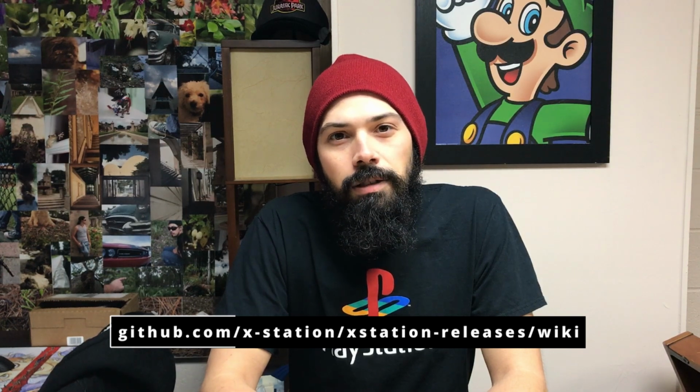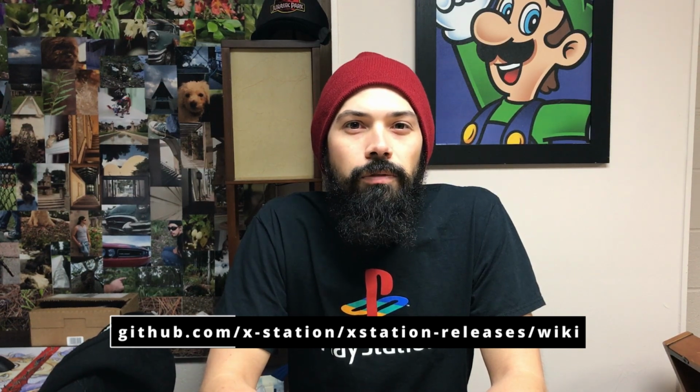Now that we've got our motherboard out, we need to do some prep work before we can finish installing the Xstation. I'm going to leave a link to the GitHub page for the Xstation in the description, and you can just see the web page down here at the bottom. They've got detailed schematics on what components need to be removed and what pins need to be lifted on what chips. But for now, let's get that done.